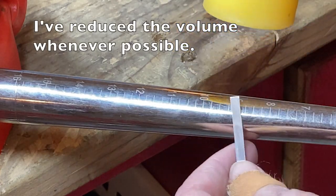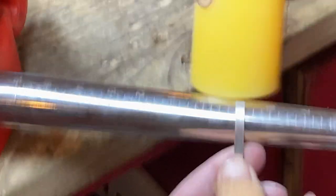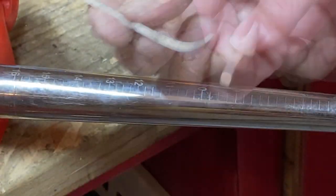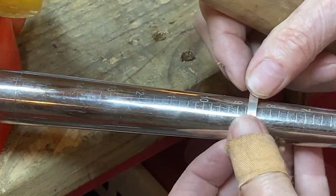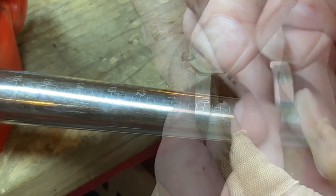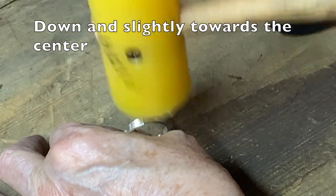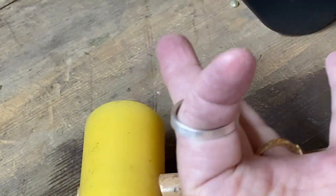This is a size 10 so I'm going to start on the 9. I'll bend the ends, flip it — remember this is a cone — and start forming on the 9. Now I have a start and I'm going to keep forming. This needs more hammering. It looks pretty even now, so I'm going to start tapping down a little more. That looks beautiful — this is ready for soldering.